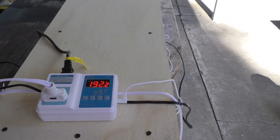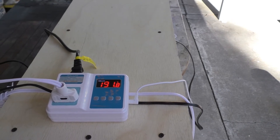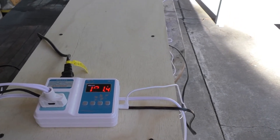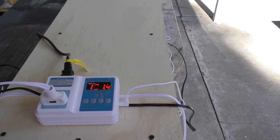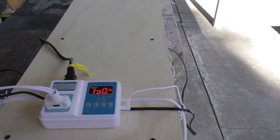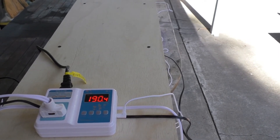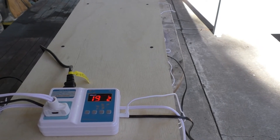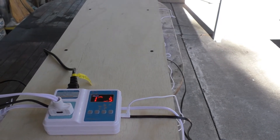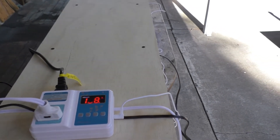I think I have it set to 180 to 190 degrees. Depending on your particular oven, you need to do a little calibration on the controller, because when it turns the light bulbs off the temperature actually coasts higher for a while. As we can see, it's at 191.4 right now and coming back down — light bulbs are off. When it gets back down to 180 it will turn them back on, but the temperature will continue to drop to about 175. So I need to reprogram and account for the overshoot at the upper end and the lower end to hold an accurate range of 180 to 190. This little controller is available on Amazon — I paid about $32 for it, so it's a pretty good deal.